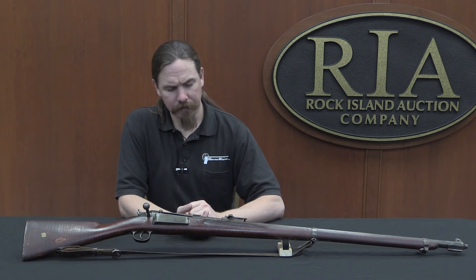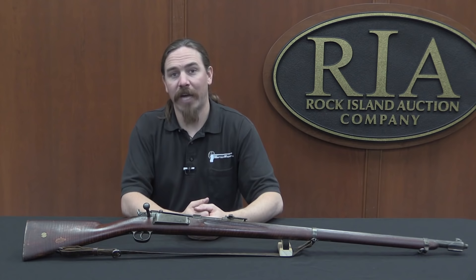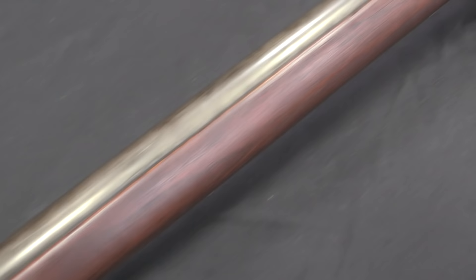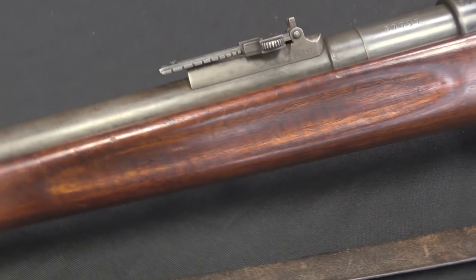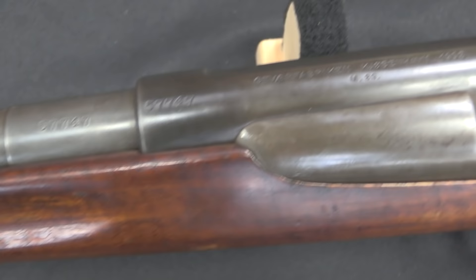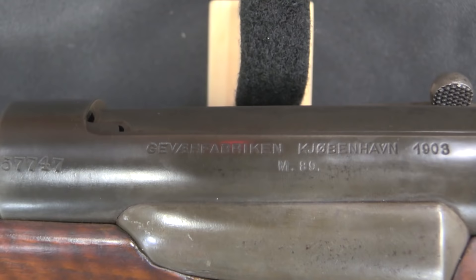The Danish version is a bit different. For one thing, it has this big barrel sleeve, or barrel jacket, on it. That is an idea taken from the 1888 German Commission rifle. The idea of a sleeve or barrel jacket like that is to actually increase accuracy of the rifle by effectively free-floating it, so that the stock is not actually in contact with the barrel. Pretty much everyone realized eventually that this was unnecessary and extravagantly costly. The Germans ended up ditching the sleeves when they went to the Gewehr 98 from the 88.